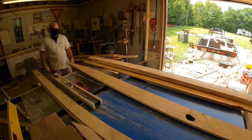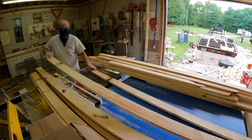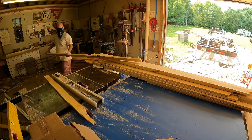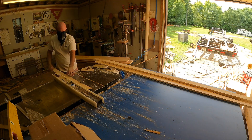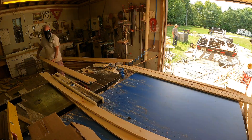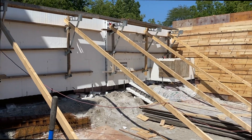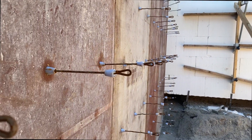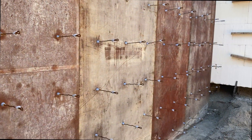I built this house back in 2018 and the architects and I came up with a way to do a form liner on my Gates forms with number four rough-sawn pine — like you might see someone use for roof decking. We cut it up into different dimensions that add up to the right spacing between my ties, and it makes a really cool board form look, which is really popular right now, without using form liners, because I hate seams. We're using the cone ties — these are Gates camlock ties — on this wall because it will be completely buried once we pour it.